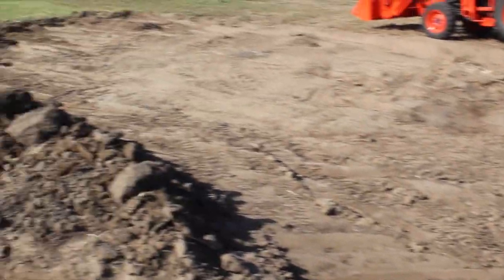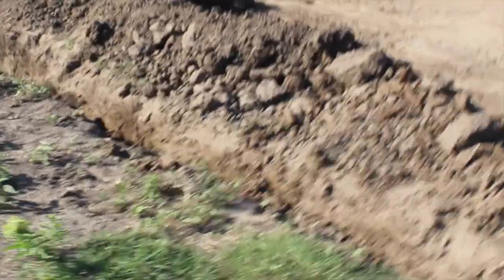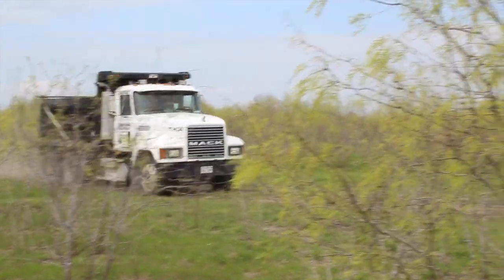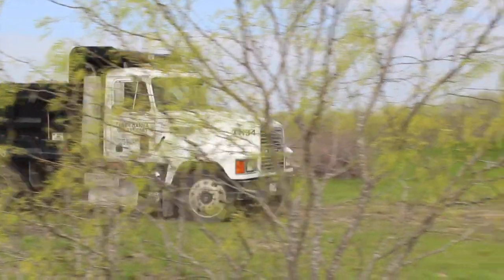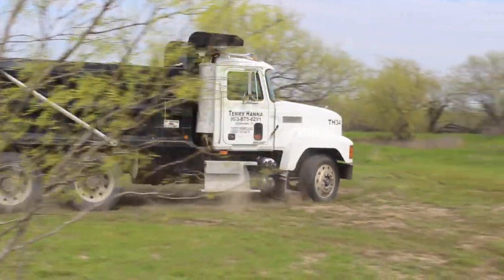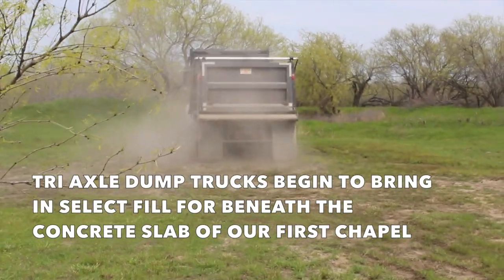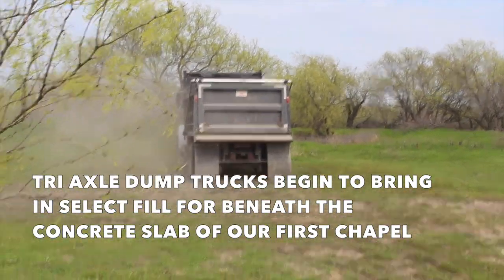You need to do a 6-inch slab in East Texas, and you need to put a lot of rebar in it. We already ordered the rebar. I ordered number 5 rebar for in the footing, and number 4 rebar, 1 foot on center for the slab.